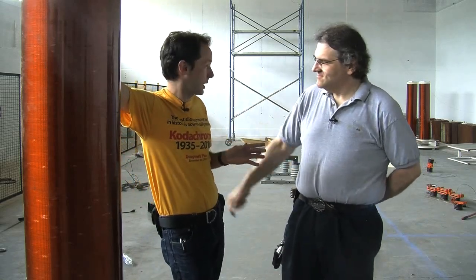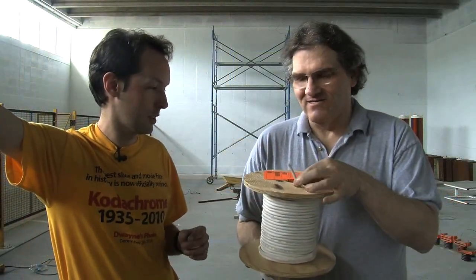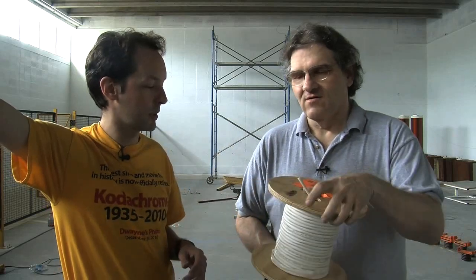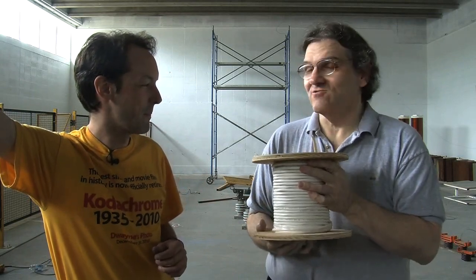So we've got special wire — it's 18 gauge, 10 conductor, plenum wire, not jacketed. Plenum wire means you can safely run this through heating plenums and raceways; it's a fire safety thing. We're putting this inside conduit anyway. We're going to run two lengths of this through the conduit, so we'll have 20 conductors going from the control cabinet to the variac cabinet.